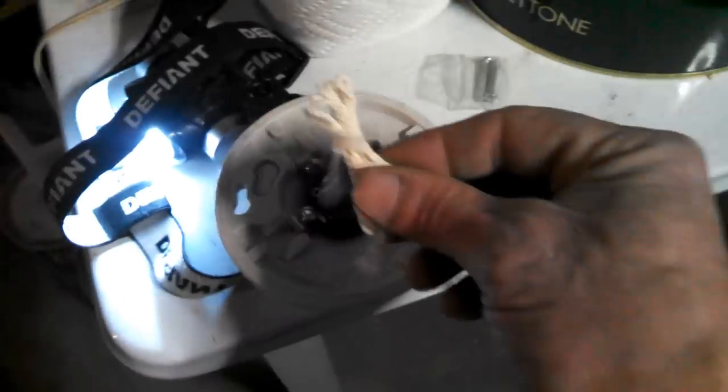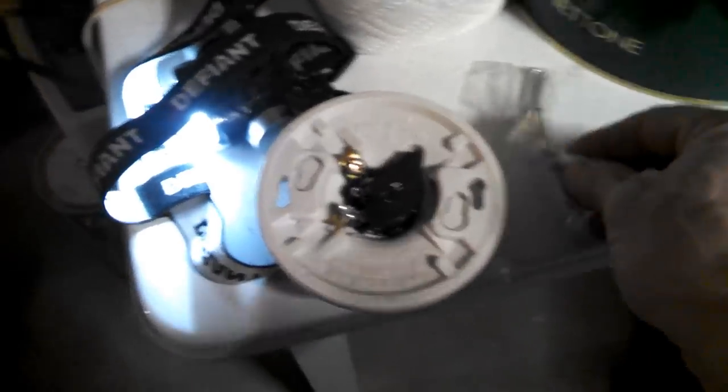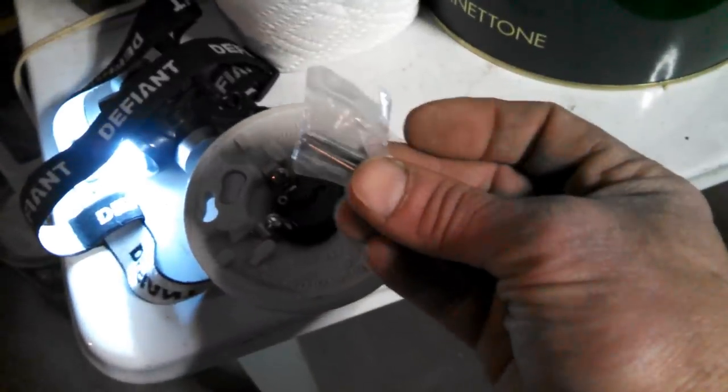And usually in the box, you'll also get the replacement pull string. And these are the screws that go up in the electric box. See if we can get some light for you guys. These screws go in there and over there. And then you put the lamp socket up and twist it a little bit in the keyholes, and then tighten and make it nice and tight.